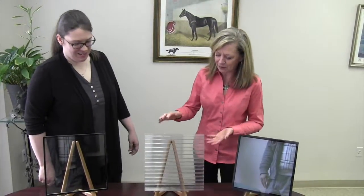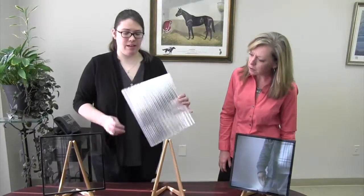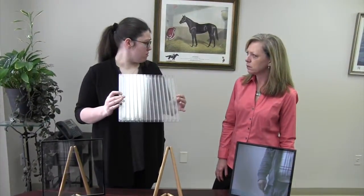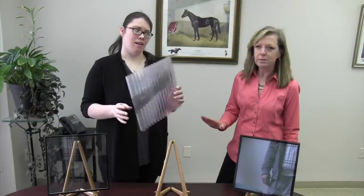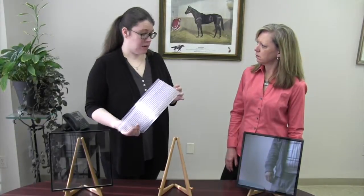In the middle we have plastic, and I find it very hard to wrap my head around the fact that plastic offers thermal value. And actually a pretty good one — the R-value on a one-inch with seven walls is actually 3.4. This one's a three-wall, and this is a multi-wall polycarbonate. This one doesn't come with any kind of low-E coating and you can't fill it with anything other than air, but it does offer a pretty good R-value for what it is.